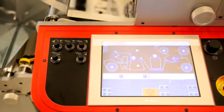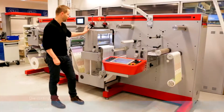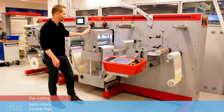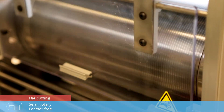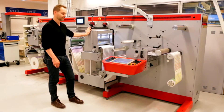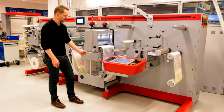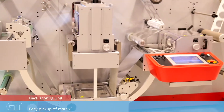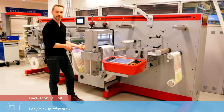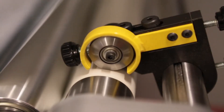At the end of the machine, we have the operator desk and we have the die cutting cassette. The die cutting cassette in this machine is semi-rotary. That means you are format free — you can run any size of label without changing the heavy die cutting cylinder. You select the plate for your job and you can run the same day. Next to the die cutting station, there is a backscoring unit. The backscoring will allow you to pick up your matrix in an easy way. You can also use this unit to do perforations.